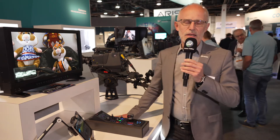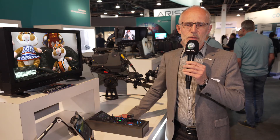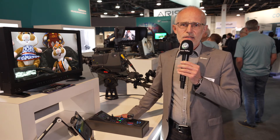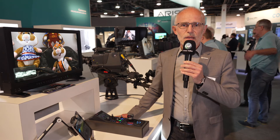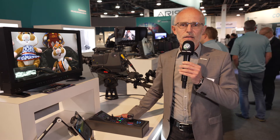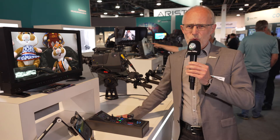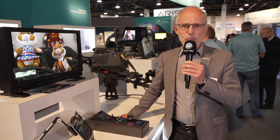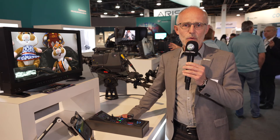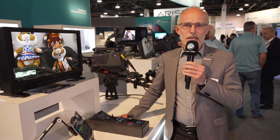In the background we see the LDX150, which is our new top-of-the-line camera model providing up to triple-speed UHD operation with full performance. It offers outstanding sensitivity and dynamic range in any operation format and provides global shutter operation in any operational format we support. The camera also offers a new feature called native IP operation, where the camera directly streams SMPTE 2110 signals into the IP network and can subscribe to IP streams for return video, teleprompter, and other functionalities.